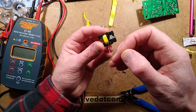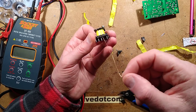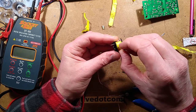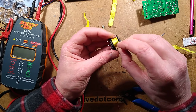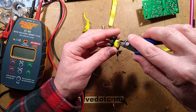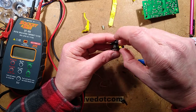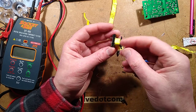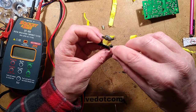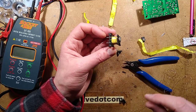Oh yeah, kind of thinking I don't like that. That is very close to the... It's the same old story. They don't keep them separate, in the sense that where the windings come out, the secondary windings, the supposedly low voltage ones, the other ones end up at some point wound up against them. They're supposed to kind of keep them separate. This is where the double insulation of the wire... You get the double or triple insulated wires that actually have super thick insulation, but that's where that's coming out there. I wonder if that's where it's actually failed.